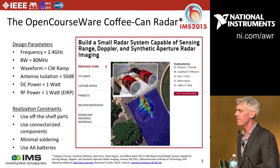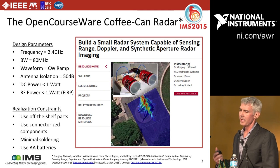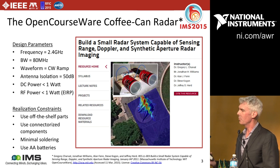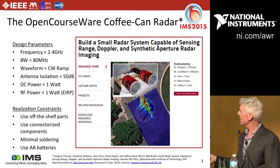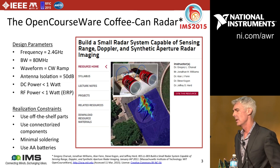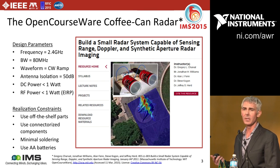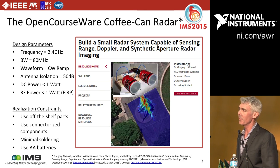To give a quick overview of the MIT OpenCourseWare: five professors put together a series of lectures describing how radar systems and RF systems work, how to put the radar together, how to use it, and how to process the information to get ranging. It was based on the 2.4 GHz ISM Wi-Fi band, using connectorized Mini-Circuits parts with SMA connectors, breadboard components, and a laptop to sample the down-converted IF for baseband processing in MATLAB.